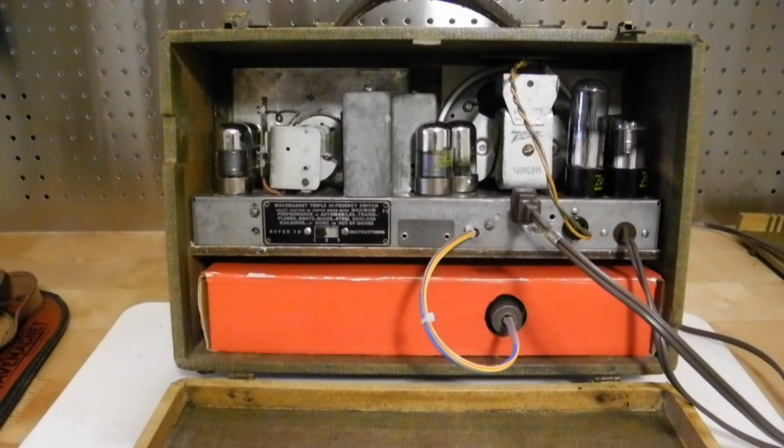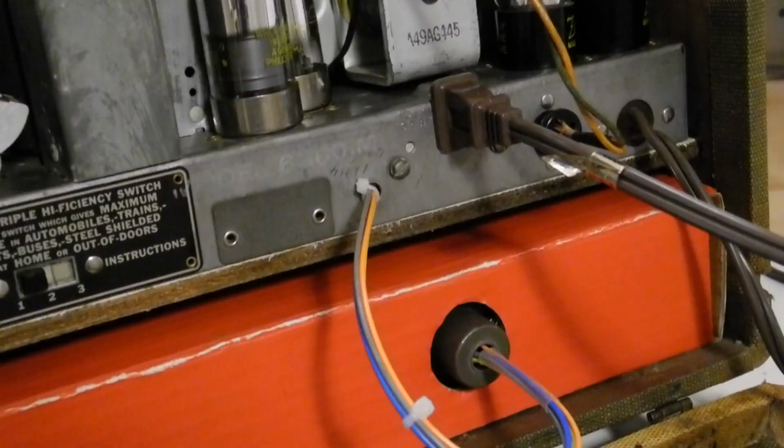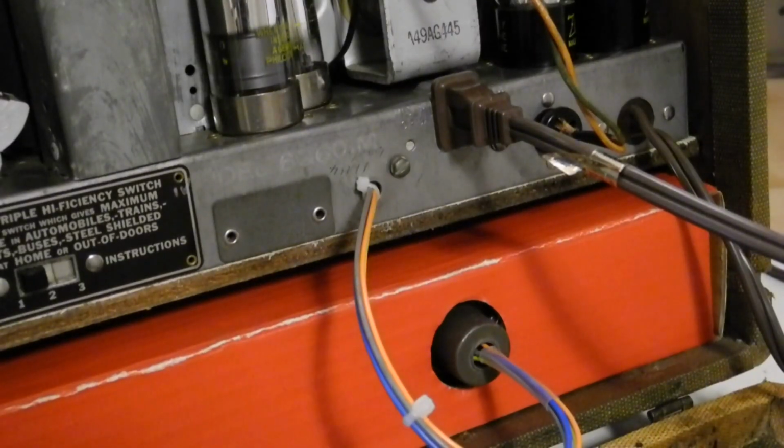It supplied both 9 volts for the filament A supply and 90 volts for the high voltage B supply. The 5 tubes when in series added up to the 9 volts for the filaments. To use the battery, you would connect it via the cable and then insert the AC plug into openings in the rear of the chassis, which activated a switch to change the power supply wiring.